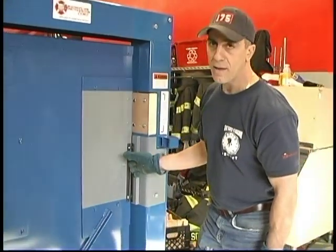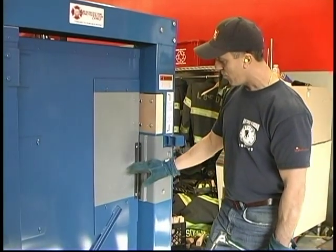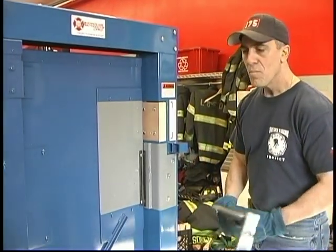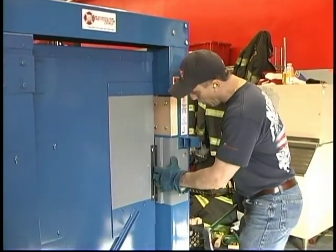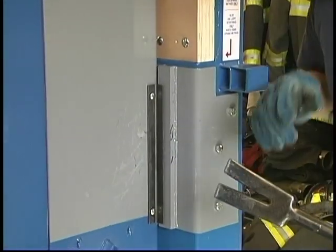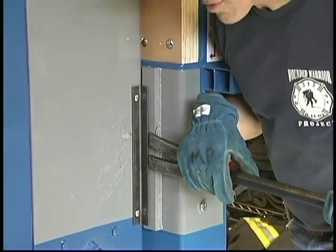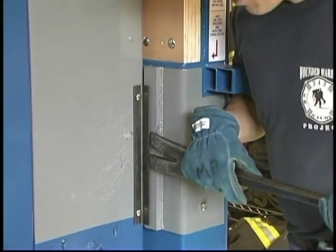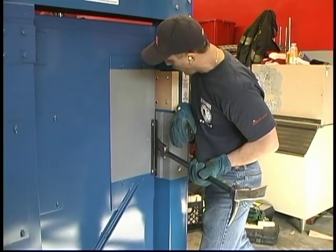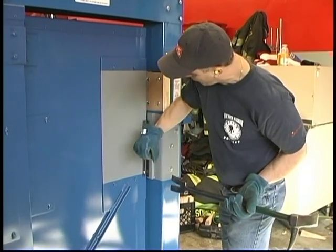In that case, you've got to attack it. Sometimes they run it the whole length of the door, and you have to attack it. And when you see how we do it, you're going to realize it's not as hard as you think. What we're going to do is approach the door. The objective is to drive this fork to the door between the angle iron and the stop. Once I hit the door, I'm going to bend and steer this fork to go around the jamb, the way we forced before. The thing is to get this fork to the door and then steer it around.